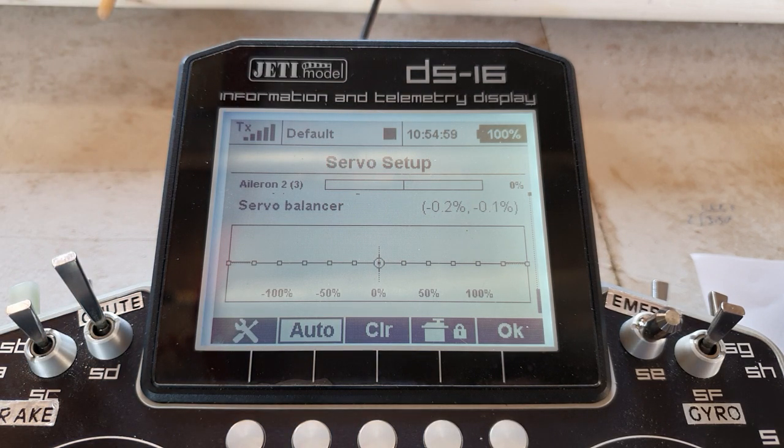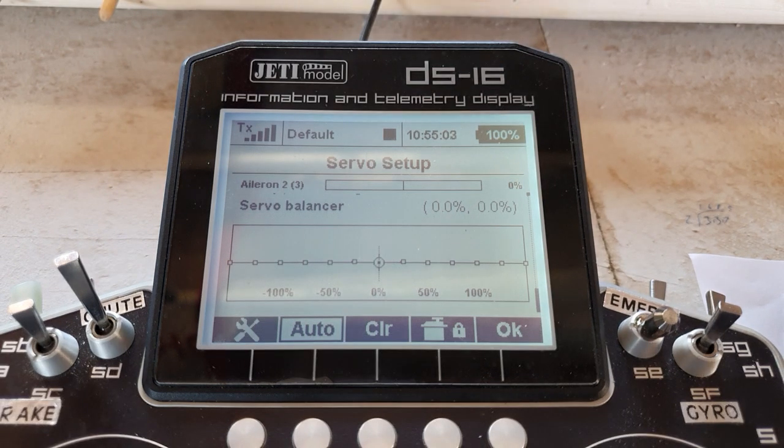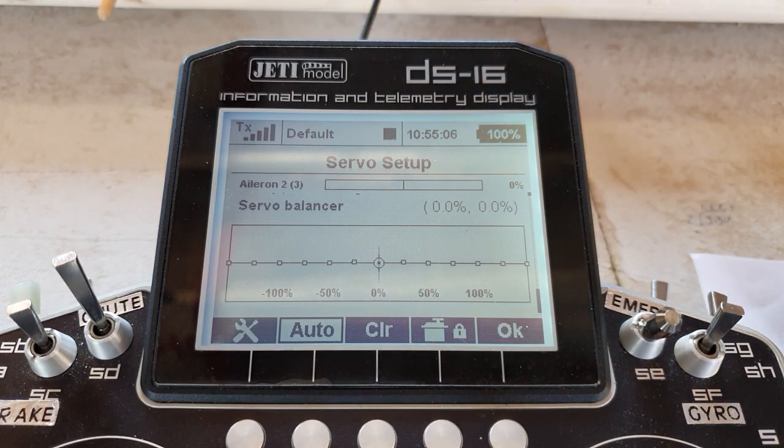And as I say, frankly, if you have spent money on budget servos, they will not respond to a 0.1% change. In fact, you'll be lucky if they respond to 1% change. I have bought second-hand models, which basically I rip the so-called good servos out, put them in the bin, and buy properly good but expensive servos. I'm afraid you get what you pay for. One second-hand model I bought had been fitted with a brand of servos which, shall we say, shares a name with a pandemic that's currently shutting down the world. And in most cases, if you tried adjusting subtrim, they wouldn't even move until you got to 5% change, and then they jumped. They were in landfill by the end of the week.